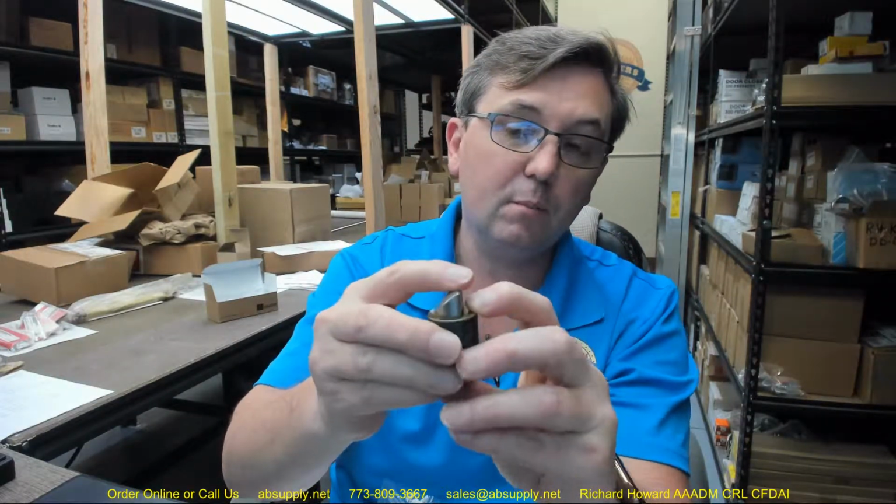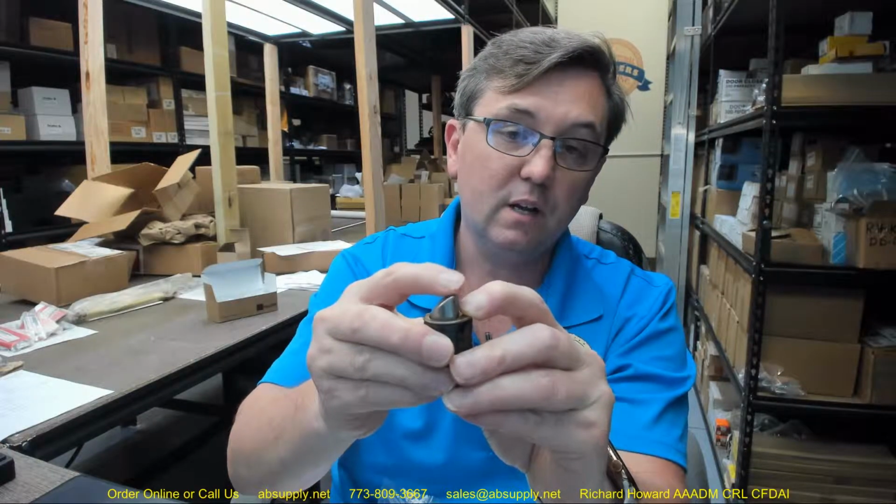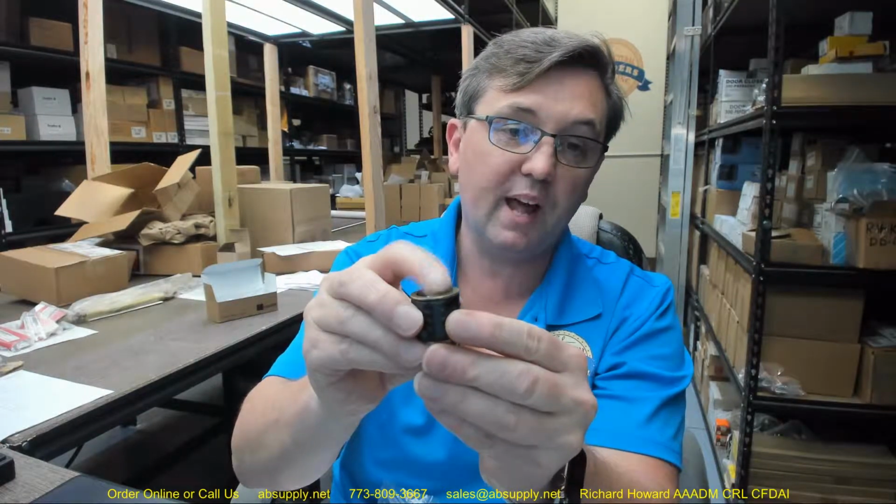The deadlocking feature, when that deadlocking tab is held in, you are then prevented from pushing the latch down. This is a spring latch, so it can always move. The rest of the catalog is handy because it will allow you to review other associated items that go along with this stuff. Backset extension links are there as well.